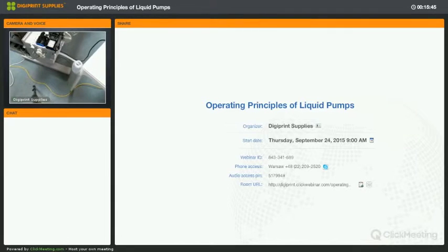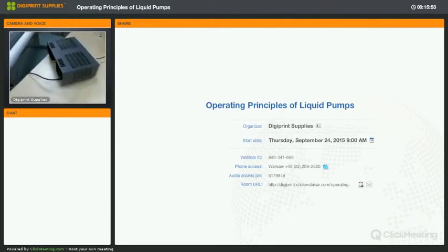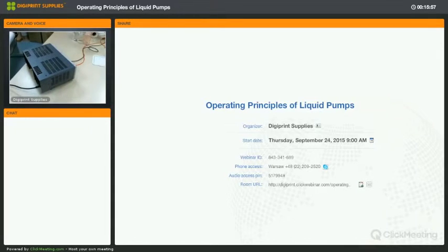Now, take a pump to test. Reposition my camera. Like this. We've got a power supply here that can run 24. Just going to shut this one down. Okay. So that power supply can run at 12 volt or 24 volts, which are the voltages usually required by diaphragm pumps. And what we'll do is we're going to check the flow of our pump. So I'll take a stopwatch. And flow is always expressed in how many milliliters it can pump in a minute.